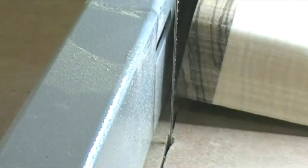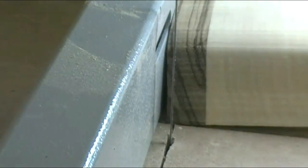itself, and what I need to do is I'm going to cut off a quarter inch from the front and back, and then we're going to hog out the sides. Now I don't have it sitting normal, straight up and down like you would normally have it, as if it was going in and out of the actual drawer itself. What I've done to cut it is I've got it upside down to prevent it from rocking. So this way it's not going to rock back and forth.